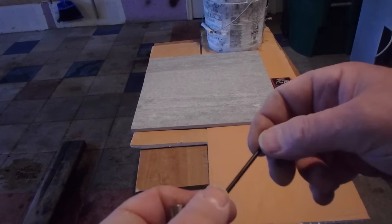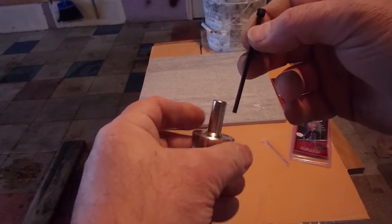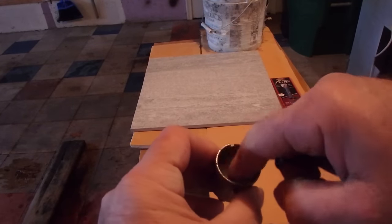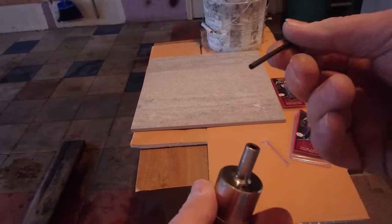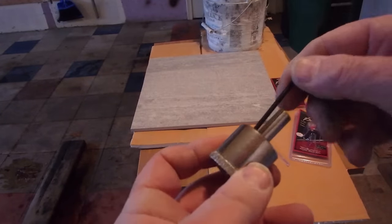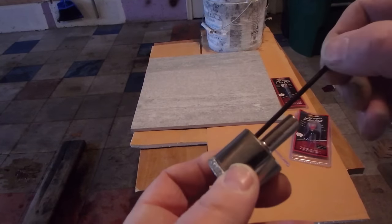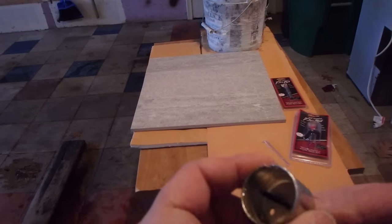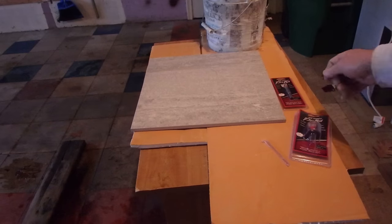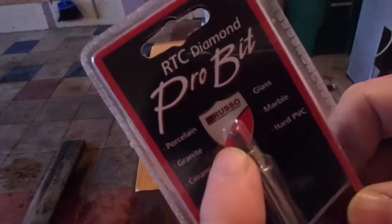This tool has this little rod that comes with it. I didn't actually realize that until I just opened it. What happens is when you cut a core bit, the piece of tile usually gets stuck in there, so this is so you can push it out. I usually use an awl or something, but these actually come with a little tool here to push out. You can even go through the center here to knock out the piece that might get stuck in there. This one comes with a tool too - see it right there.